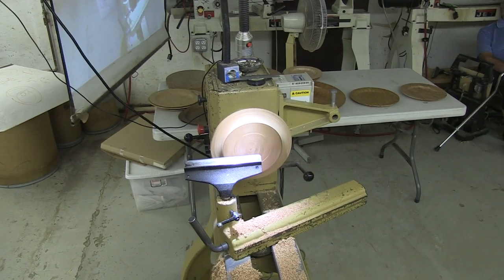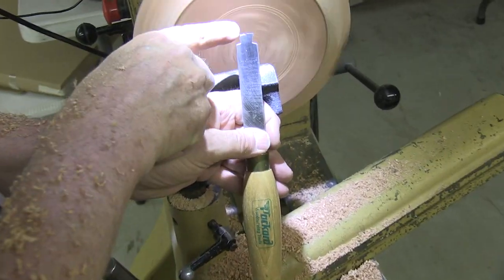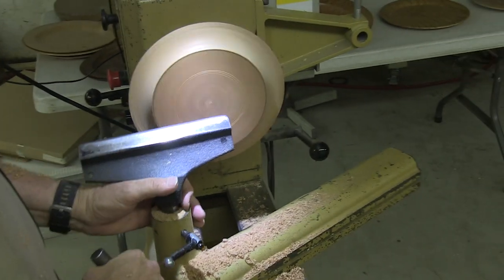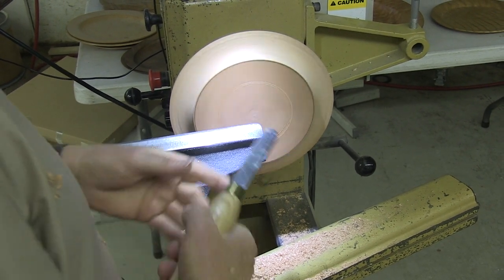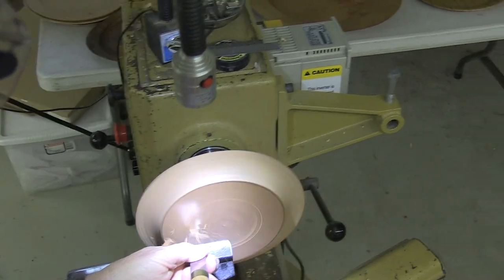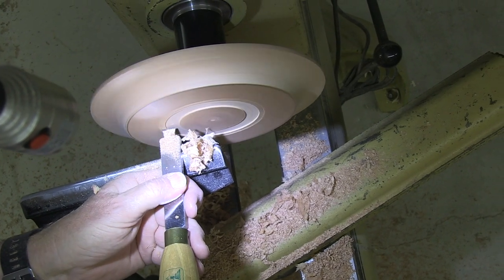This is by Packard Tool Works. It's a dovetail scraper. So it's going to be used to cut the inside dovetail in this recess that I'm going to cut here, which needs more speed. Now, I'm going to present the scraper in this form because I'll get a little bit smoother cut. I'm not going to go flat as I usually might. Wiggle it side to side till I get about as deep as I want.